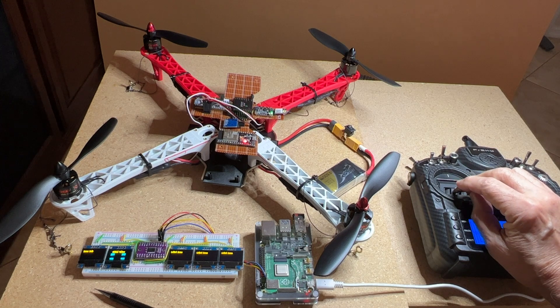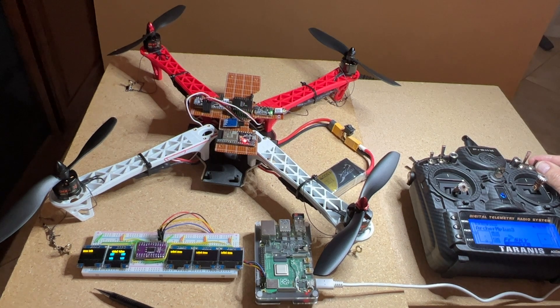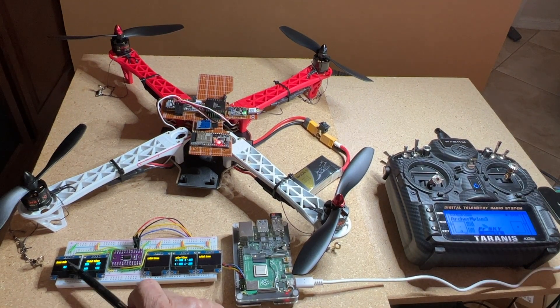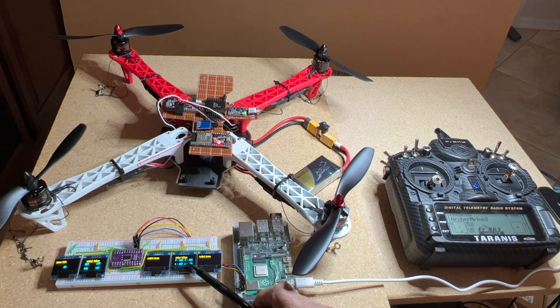Notice that the propellers did not move, because there's a D switch — it's a three-way switch. If I click it one time, you get a 'set' notice, which makes these gimbal values no longer the raw values but using the limits mapped into the 1000–2000 range. At the same time, when I did the set, you see the motor values pop up. This will show the values going to the motors, since they are different than the gimbals based upon whether you're in a yaw, pitch, or roll — different values that are additive to the throttle.